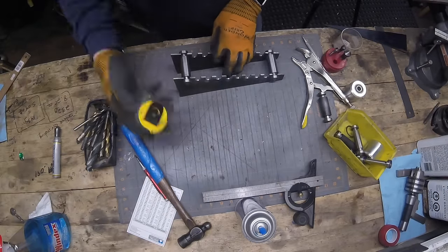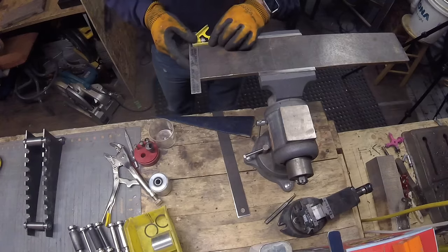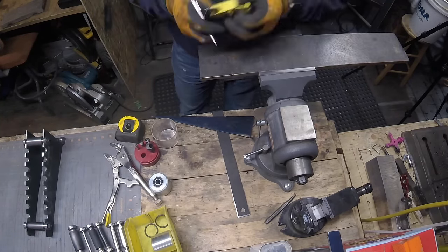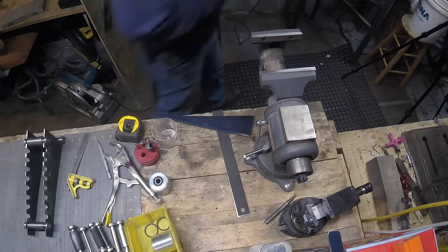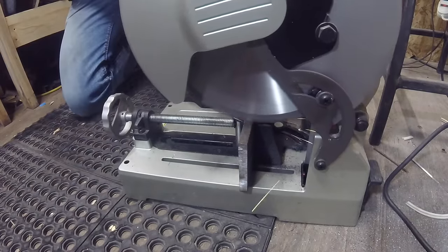Then I went with two and a quarter inch spacing between those two side plates. I chose that because I wanted those plates to be quite snug with the inside of both bearings. The reason for that is that the quarter-inch wheel that I have actually has a shoulder machined onto it.